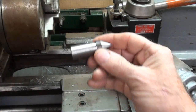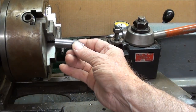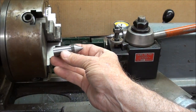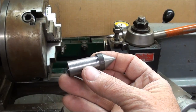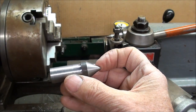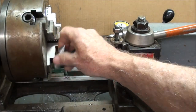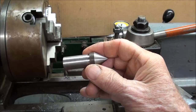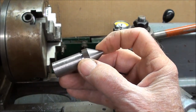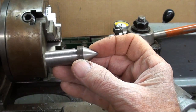This is turned down to any old diameter, but you do want a step here — a shoulder — so that it can be put into the jaws up against the shoulder and can't get pushed back. If it gets pushed back even a little bit, that would throw off your timing or location. After it is in the chuck, whether a three-jaw or four-jaw, you need to take a light cut to true it back up — unless you want to take the time to indicate it in the four-jaw within half a thousandth. In a three-jaw chuck, more than likely your chuck is off, so you need to take a truing cut, just enough to bring it back into conformity. And do not take it out of the jaws until the job is done.